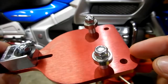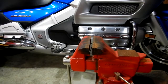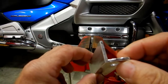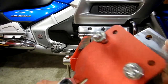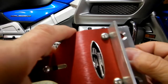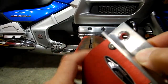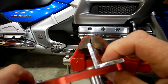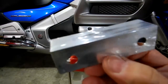I came up with an idea of what to do here — to add to this so that I could use it in a vise. I made up this plate out of one-inch by one-inch angle iron, eighth-inch thick, and I located these holes so that this bottom side would go right up even to those cap bolts there, and I would bolt that on.